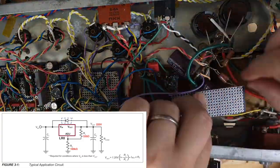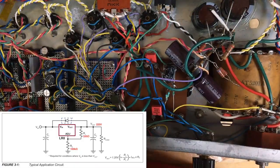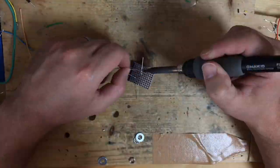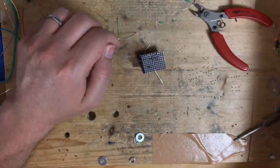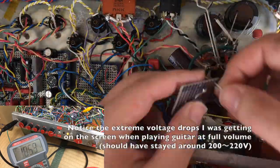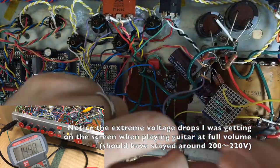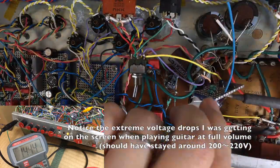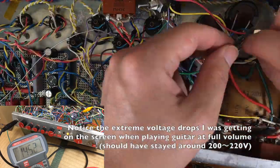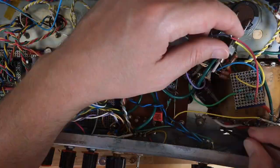The idea was promising, and after tuning it a bit, I was able to get some good results. But the small TO92 package I had to get for the IC was only able to dissipate the amount of current it had to on paper. In reality, it was getting too hot. So while I could have probably fixed the problem by changing package or by adding some power transistor to supply the required current, in the end, as I already had a switch added anyway, I decided to just go the simplest route and I ended up with these bad boys.